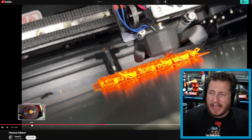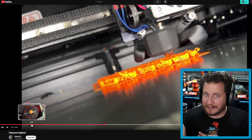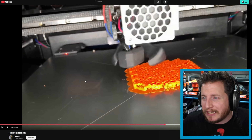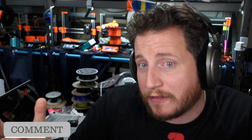It might not be running hot enough — that is absolutely something to look at. Either that nozzle has a little bit of gunk on it, or that's not the stock Nextruder nozzle. Looking at what we can see, my best guess is that it is running a little bit cold. I find that the Core 1, and most Prusas for that matter, even running Prusa-brand PETG, need to run hotter than what the stock settings say. We often find we're turning up temps between 5 and 15 degrees Celsius above stock temperatures simply to get better quality printing. It could be an altitude or barometric pressure thing — filament, especially when hot, can do some weird things in different environments.